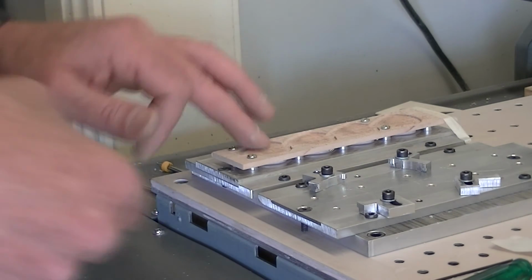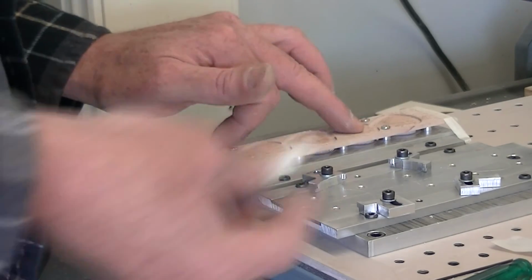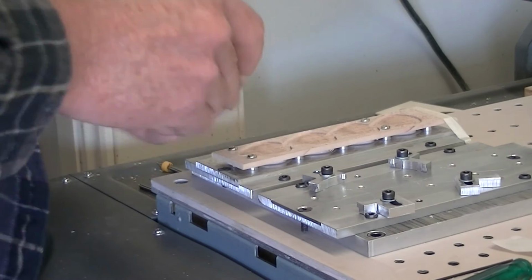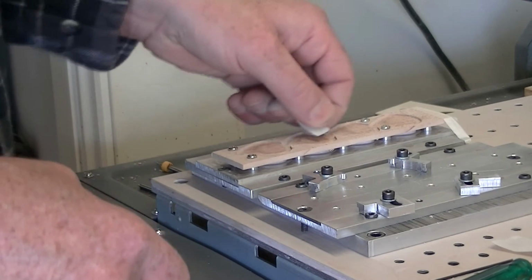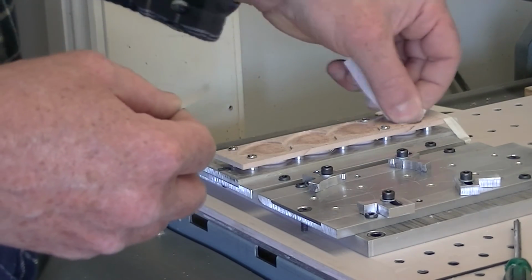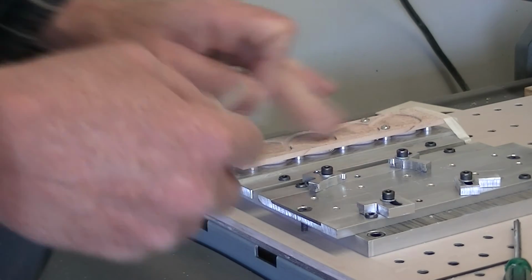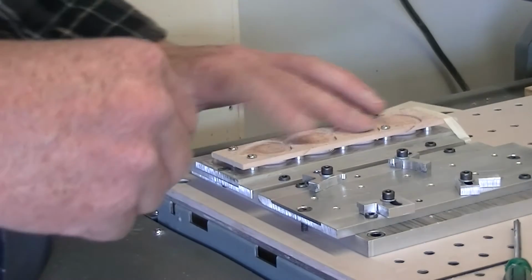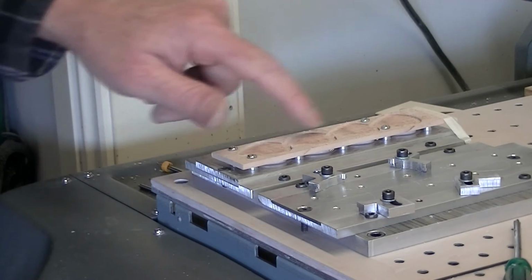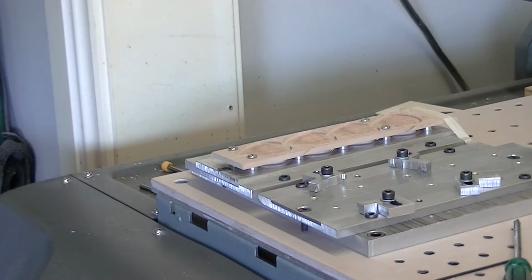Okay, now because I've put some super glue on this surface to harden it up, I use a little bit of sandpaper, basically rub off the thumb indentation. I think that's 400 grit. Then with a bit of 1200 grit, smooth it all off again. So hopefully now the pores of the wood have been filled. But of course I filled up the engravings as well. But that's fine because it's easy enough just to do it again. I haven't reset any zeros. So we'll start again.